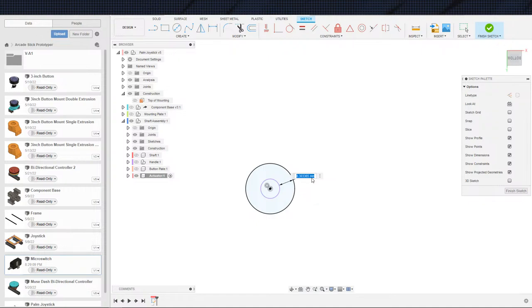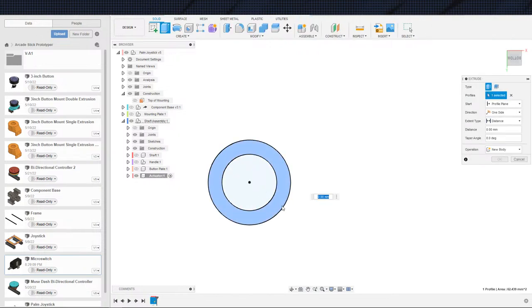Again, the size of this is going to determine some things. I think I'm going to go with 2 millimeters. Our micro switches, in theory, start 5 millimeters, I think it was, off of the shaft. I think we did -4, -5. No, we might have done -4, -4. So if they start 4 millimeters off the shaft, then we only want, you know, half that distance, let's say. And again, it may be tweakable. We may want to change that. Although the micro switches could be moved instead. So I'm just going to go the 2 millimeters off the shaft.